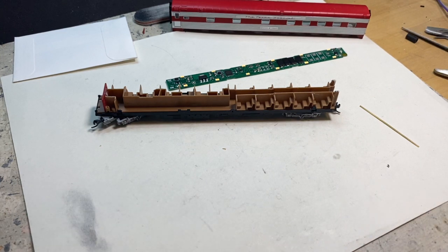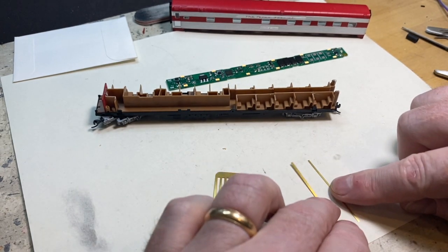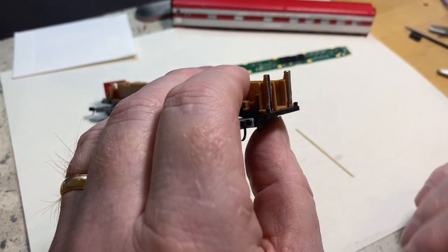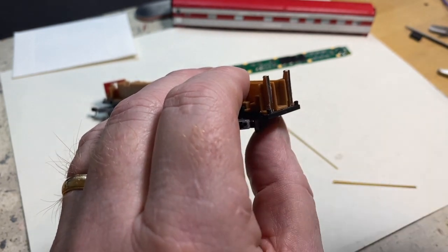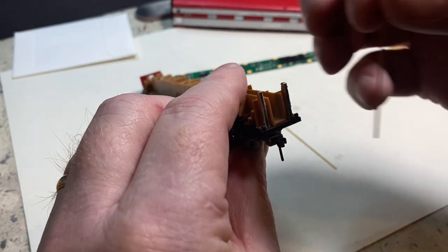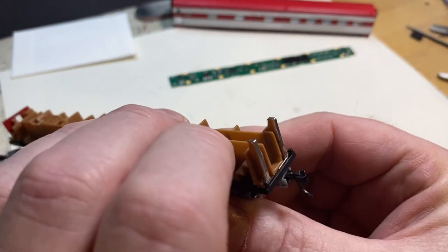On the brass strips, the middle strips are exactly one millimeter and the outside ones are a little bit wider, so I've cut both so you can see they're a little different in size. I match them up with the back of this connector. The one millimeter standard strips fit perfectly. I want to wrap the copper around the two sides of this post for a smooth corner connection to keep it together. Basically I'm going to cut a piece of tape this height, fasten it here, wrap the tape around that piece, then cut the copper strip and put this on both sides.